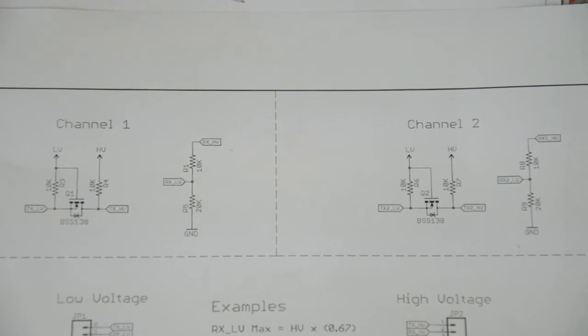think this product from Sparkfun is not that great, but not because of the circuit, but rather because of the way it is presented. If you think about it, either you know how this level shifting business works. In that case, you know that you can use a single transistor, you know that there are some drawbacks involved, and you might be able to figure out whether you should do that or not. And if you decide to do it, you just buy your transistor and design it into your product. On the other hand, if you don't know anything about level shifters and you don't want to bother about it, then you might feel tempted to just buy this level shifter from Sparkfun and it just might not work. And I think that there should be some sort of datasheet telling you under what circumstances this stuff works, and they just don't do that. So in my opinion, that's not that great.